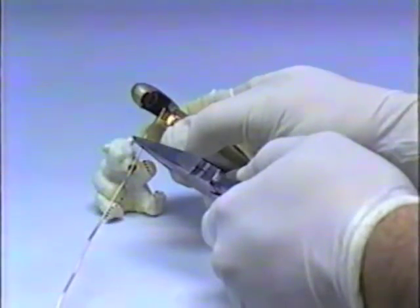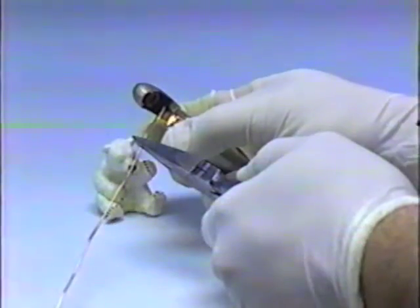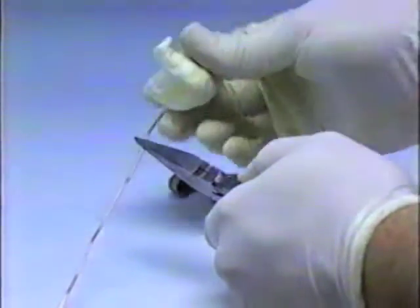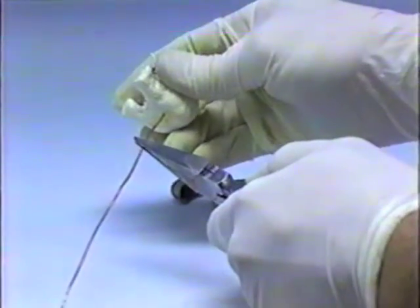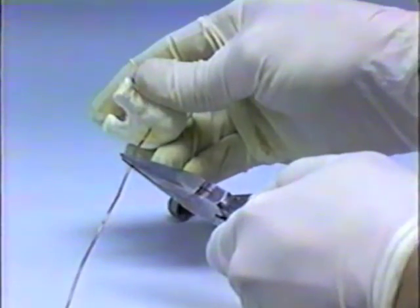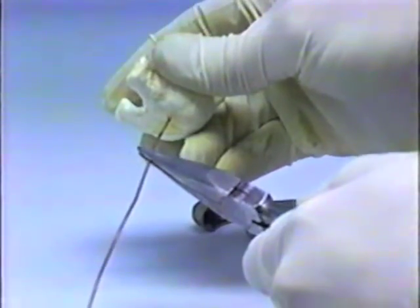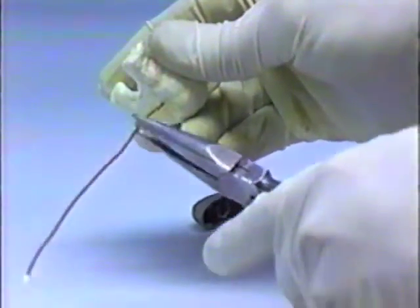There are many different ways this can be accomplished. Hot glue works well, or inserting a heated piece of wire, especially into wax or plastic. We recommend that you use a heavy gauge wire for parts which are light and may float when immersed in plating solution. This will make things easier for you later on.